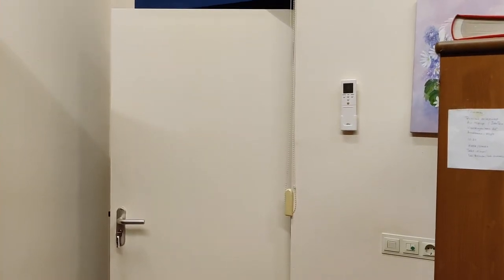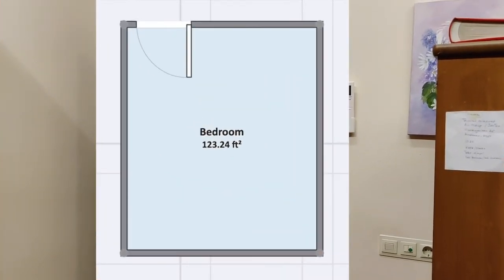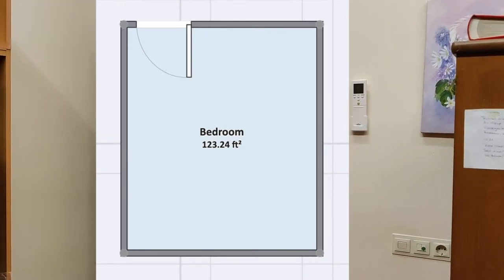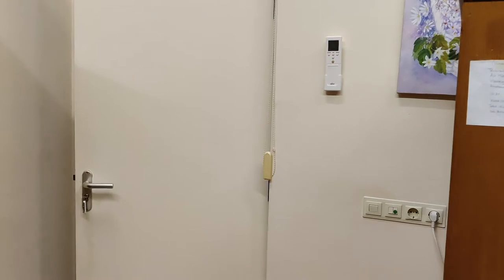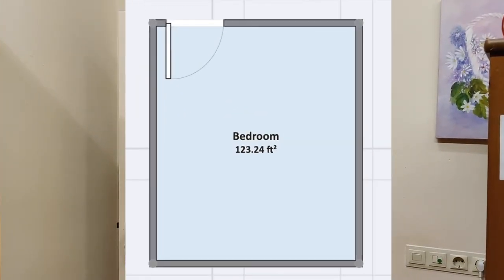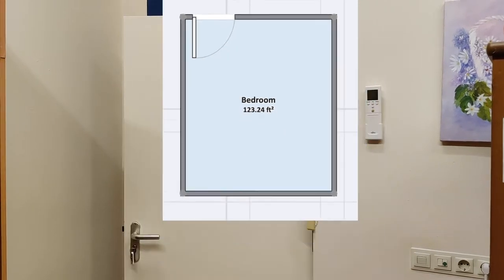What's wrong with this door? This door is a left-hand in-swing door, but it swings away from the wall and makes it hard to reach the light switches as you enter the room. This layout wastes space and will have people searching for the light switches. In this room the door should swing right instead of left. Let's go ahead and fix it.